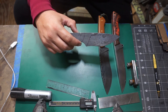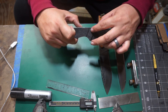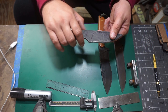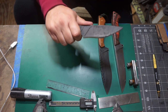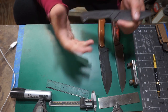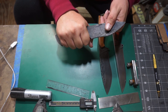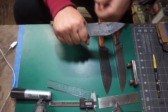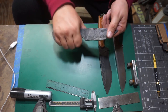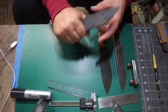It gives you a good grip without being too crazy. I see people design their knives where the handle comes almost all the way up with almost no ricasso area — covering the whole finger choil — and that's adding weight that's not necessary, especially on a knife this thick. I'm going to have plenty of material to keep my hand from sliding forward. The handle is really meant to make this area of my hand feel comfortable so it indexes in your hand. Whenever I design everything it's all about ergonomics and indexing — so no matter what, when you pick up this handle, even without any visibility, it always goes to the correct direction so you know which way is the cutting edge.